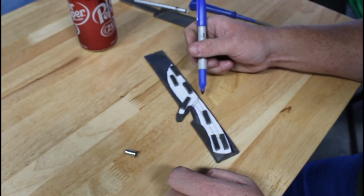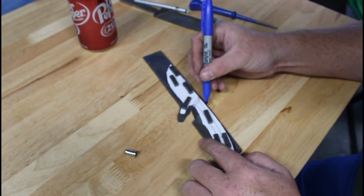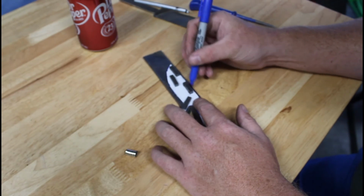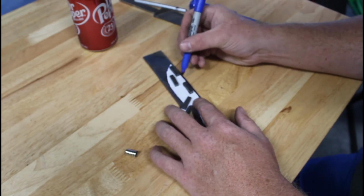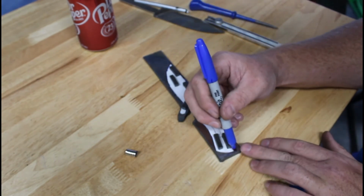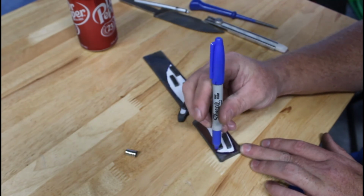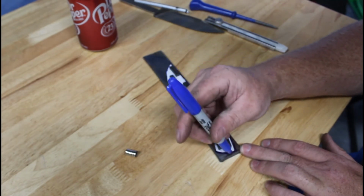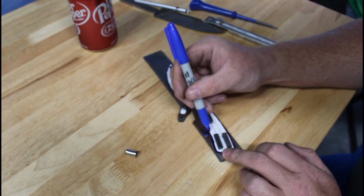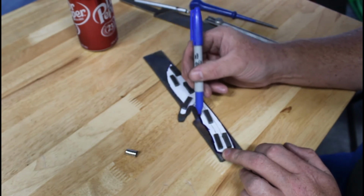And I've moved this away. I'm not using this straight edge. This is hot rolled, so the edge is already not square, it's rounded. So whenever I use hot rolled, even in a stock removal method like this, I don't leave that hot rolled edge in there. I will go ahead and make it square, or square-ish. As square as I can get in my shop.